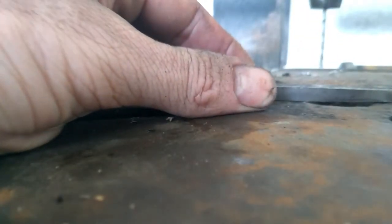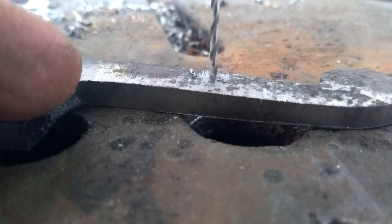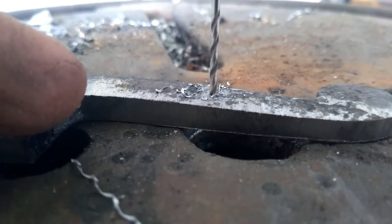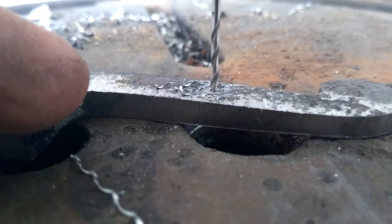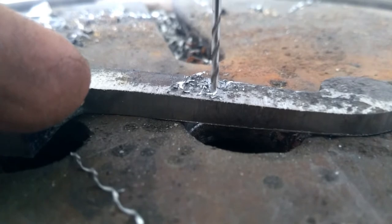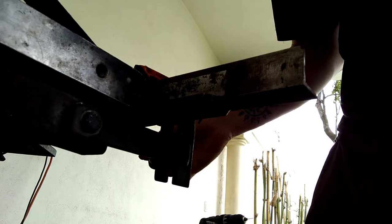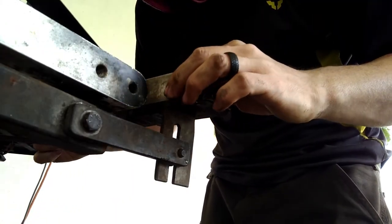Note here that I'm drilling the pivot hole before I've done any bevel making. The steel is still soft — it's not a dangerous piece of metal yet. I definitely recommend doing all of your drilling in soft steel before you do your bevels. It'll save you from potential bad times that I have experienced. If you're going to leave a comment about how I should clamp the metal — calm yourself. That is a 1/16th inch drill bit and it will break long before it pulls the metal.